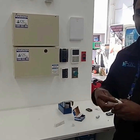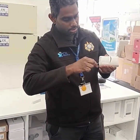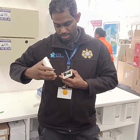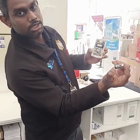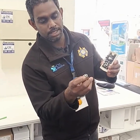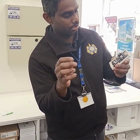For a Bosch wireless PIR, using a screwdriver, you need to open the cover, remove the top cover, and then the PIR supports a CR123A model battery. Also consider the polarity. The plus is indicated with a raised terminal and the negative is recessed.